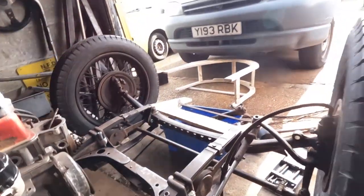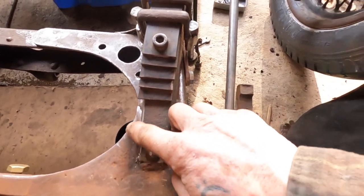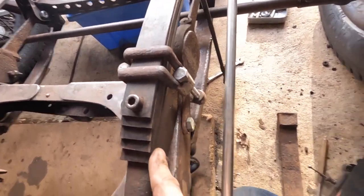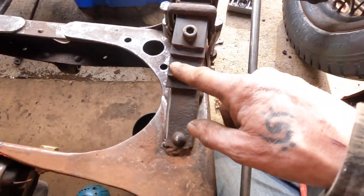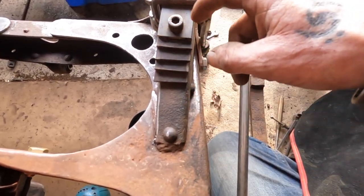If I go onto the leaf springs now - you see this isn't as wide as up there, it gets wider up there. This actually follows this edge perfectly but this comes out slightly. So what I'm going to do is slice these leaf springs down so they come narrower just on the return here, and I'm going to curve all the edges.